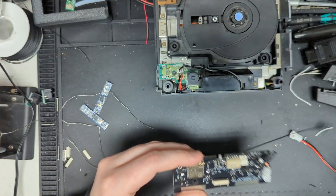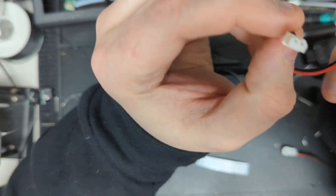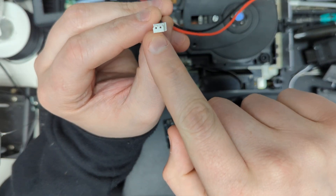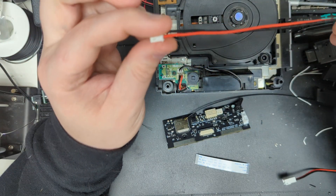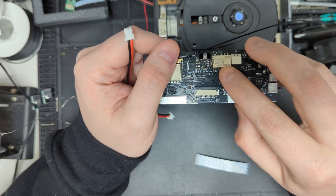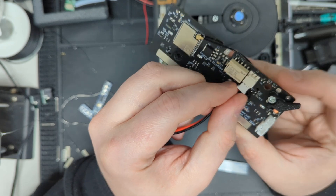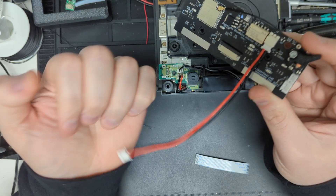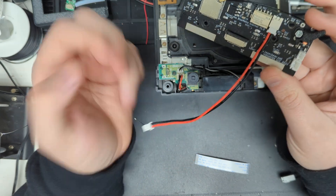In your kit you have a female-to-female cable that has these little indents at the top edge, makes it look like a couple of mountains. This is an Atom's connector and it goes into the port directly next to this relay. There's a little cream colored port next to the big cream relay and the Atom's connector just pops in. Side doesn't matter — the connectors themselves polarize the wire.